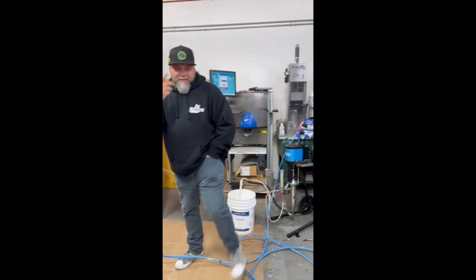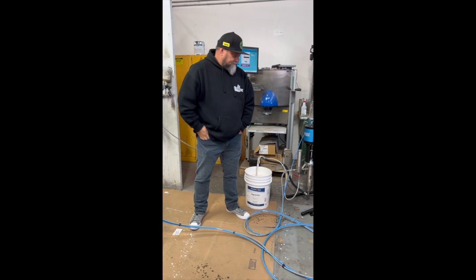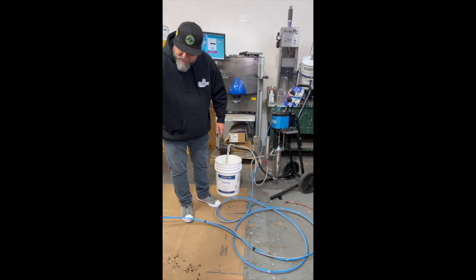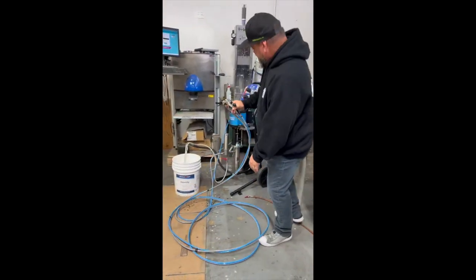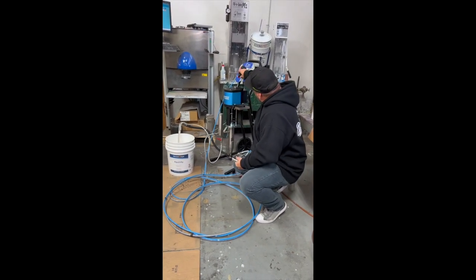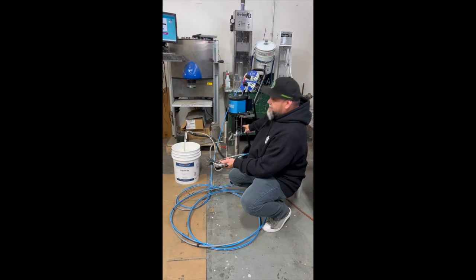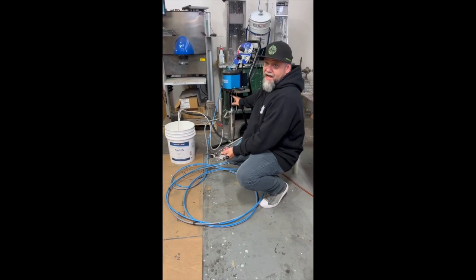When they were talking about the pump and the upper and lower ball possibly getting stuck, this is a good way to tell if you've got an upper or lower ball problem. So doing the stall check, you trigger the gun and you'll see the pump moving, and with that pressure, there you go. See the pump moving left and right. Do that on the filter, it should stop.